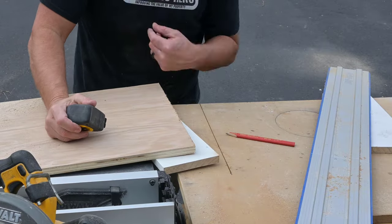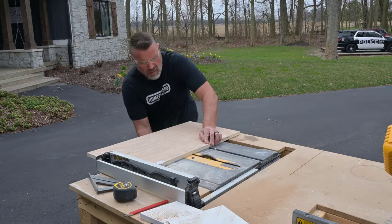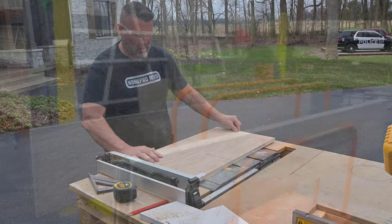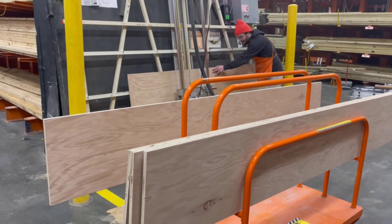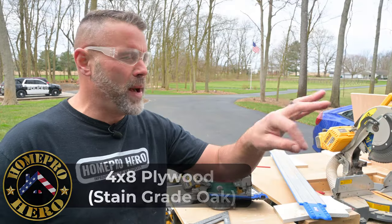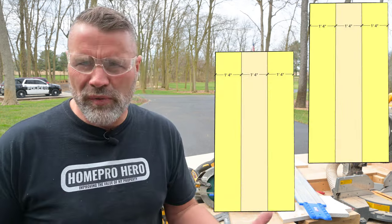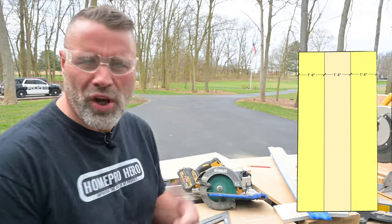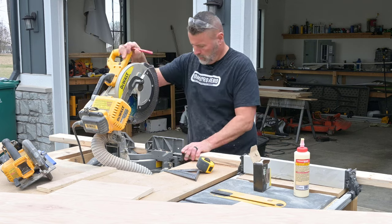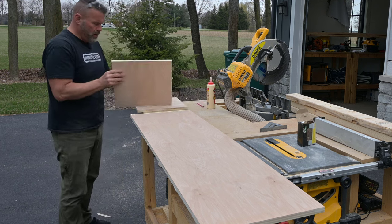Looks like the mobile workbench took a hit — I should have adjusted my saw, but luckily it didn't go through all the way. For the two sides, I'm going to use the remainder, cut it equal on both sides — probably about 14 and a half — that way I have a 16-inch lid. I went to Home Depot and had these panels cut up for me for free. I took two four-by-eight sheets and made them 16 inches — three sixteens out of each one. I'll use them for the bench and the shelves. Now I need three two-by-fours, then it's just a matter of assembling it with screws and some wood glue.